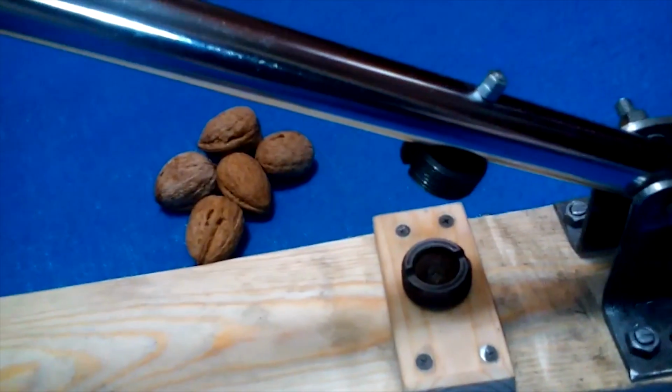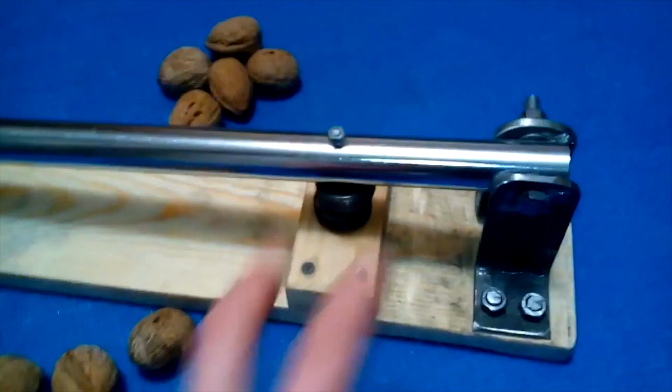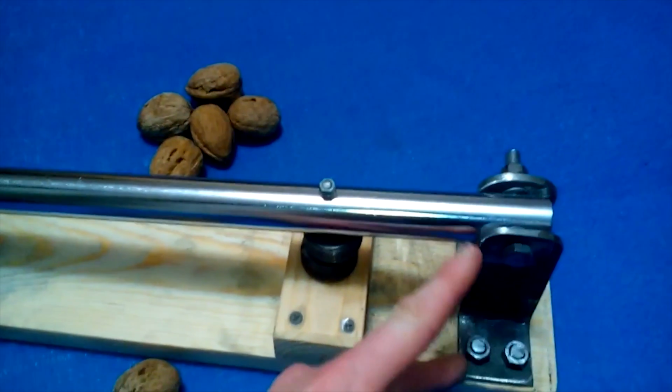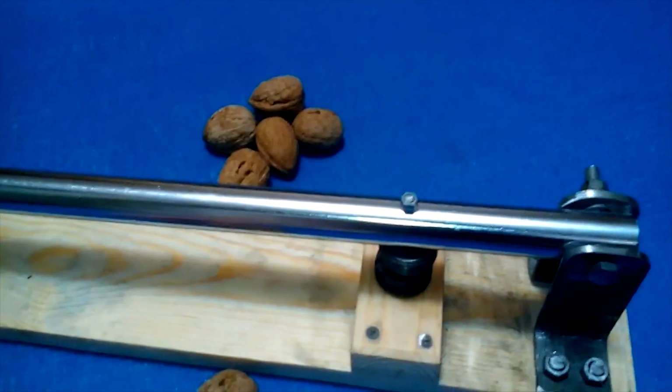To make this straightforward contraption, you can use materials you can find at a metal scrapyard. First and foremost, you'll need a base. A profiled pipe works well for this. Weld supporting legs to it, which can be made from strips of metal. Finally, on the profiled pipe, weld a nut. On the opposite side, attach a piece of metal strip bent at a 90-degree angle.